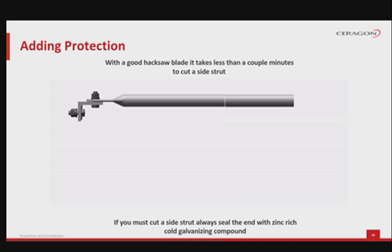What's the difference between them? How does cold galvanizing zinc paint work? The cold galvanizing zinc paint is an organic, single-component zinc coating with a minimum of 92% zinc by weight in the dry layer. It acts as an active coupling to the steel parent metal to form an electrolytic bond, protecting that surface against corrosion and contamination from other substances.